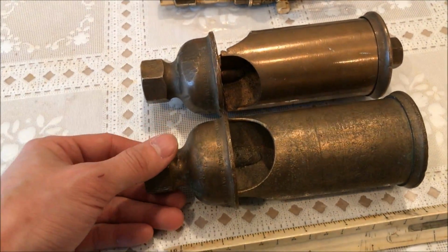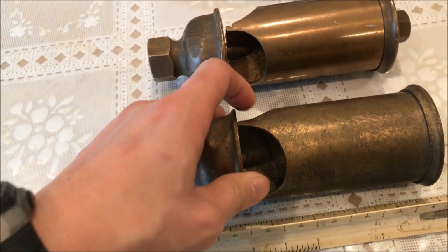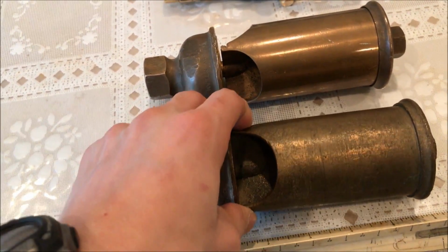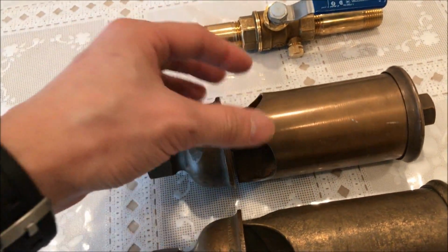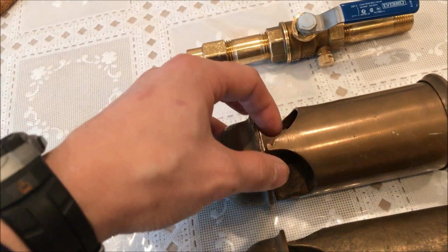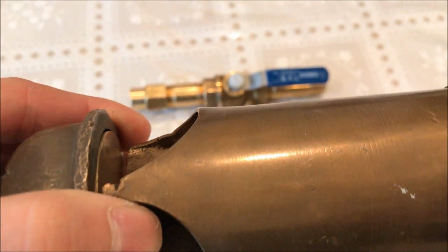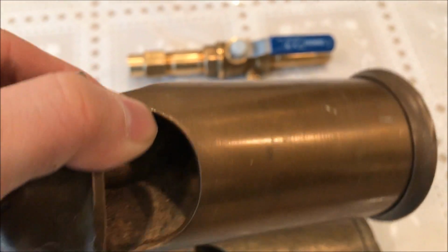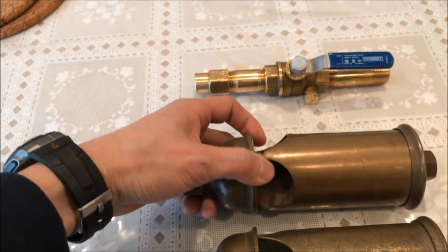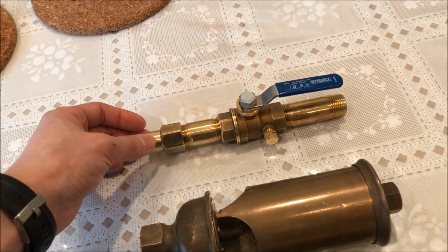Another note I want to make on the older whistle is that the bell doesn't turn freely. This is a permanent tune, which I sort of like this design better because you don't have to worry about it actually untuning itself. Whereas for the top whistle, if this rotates off, it distorts the way the air flows. It doesn't hit the bells properly. Also, the whistle up here, there are a couple deformities on it. You can see that bulge right there. That's not supposed to be there, so that affects how the air hits the air chamber when you blow the whistle. This thing up here is just a makeshift air valve that I constructed out of parts from Home Depot.